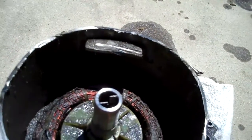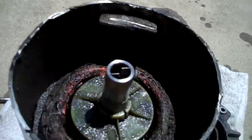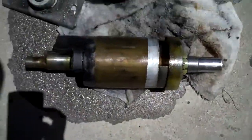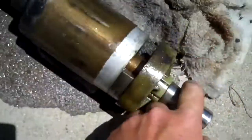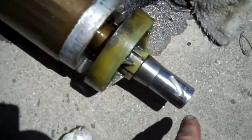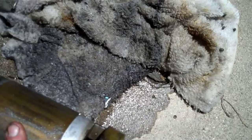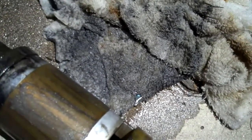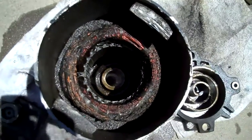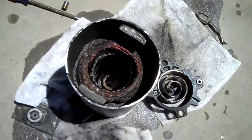I'll take the shaft out for you. One shaft coming up. Here's the plastic piece — there's a hole in the side. The oil comes down and feeds inside of here and goes down to the bottom. This little indentation might be for oil too. We've got some metal shavings in here, probably from me grinding on it. That's the bottom of the compressor — it actually comes apart real easy when you have a grinder.